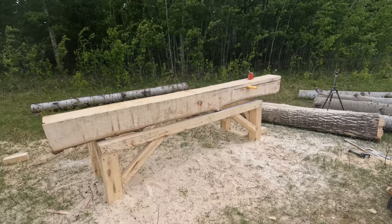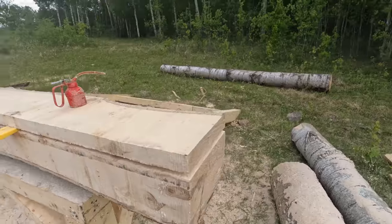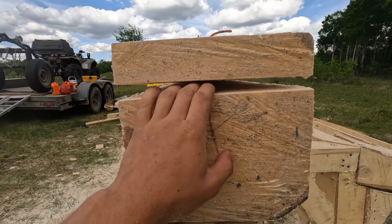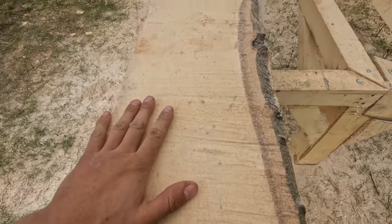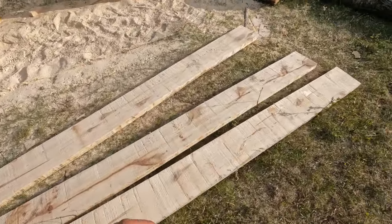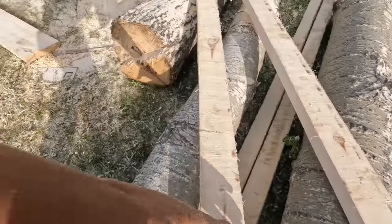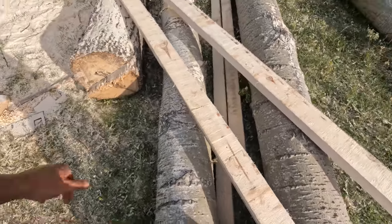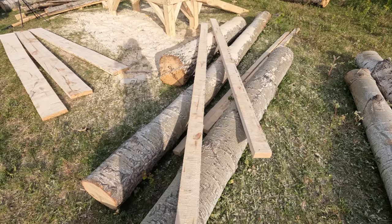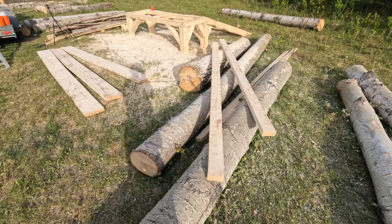Okay, guys, so now we got that third side leveled. I just flip it so the last side is on the bottom. When we start ripping off boards, these here are true 2x10s and they're gonna be deadly. Sure got some beauty boards off that one, guys. Big heavy timbers, but I made some better guide boards so I can get some a little bit straighter initial cuts on my rails, because they're only going to be as straight as your guide 2x4s are.